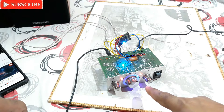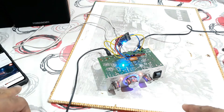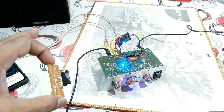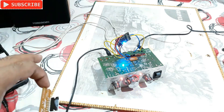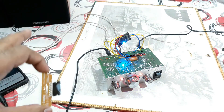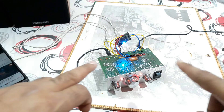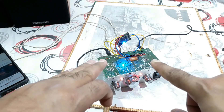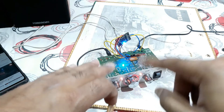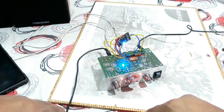This is around 40% volume and the bigger boxes are connected. The mobile preamp level is too low, so if I connect it to a PC or any other source the output would be much louder and clearer. If you're hearing any hissing sound, that's because of improper grounding between that chip and the main circuit board, which I'm going to fix right now.